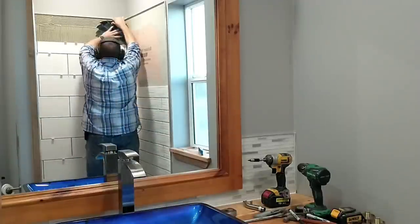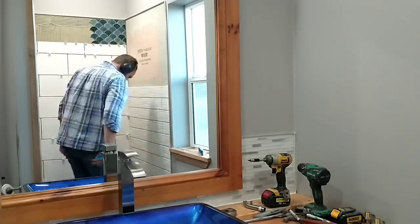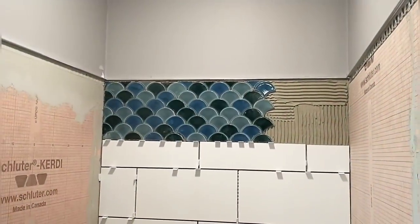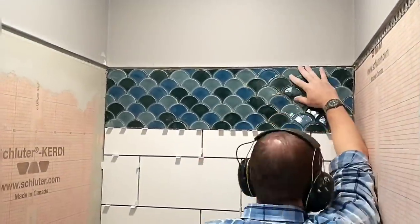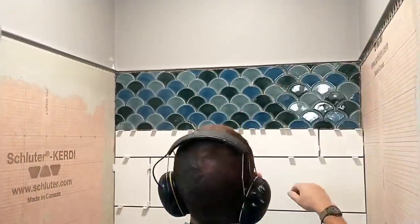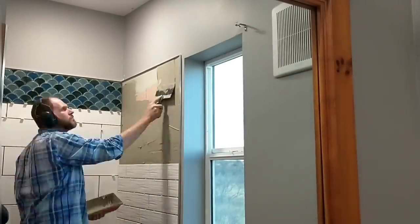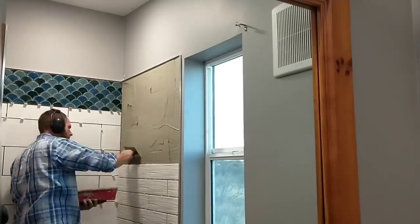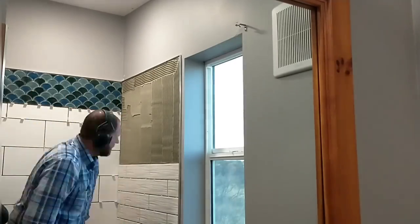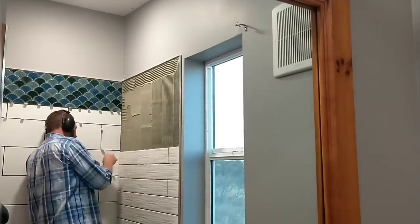That decorative tile makes me nervous. I kind of had to just pick it up and use both ends to slap it on the wall, get it stuck, and then start piecing it in. This was really tricky and definitely took me a good bit of time — I needed a lot of little spacers to get it to stay where I wanted it; it wants to sag and droop. Once that was roughly in place I moved on to the other wall, applied the mortar, put the grooves in, and got ready to apply the white tiles first before moving on to the blue shell tile.